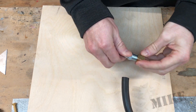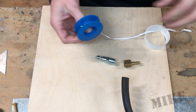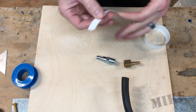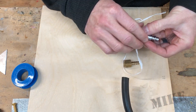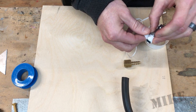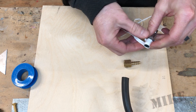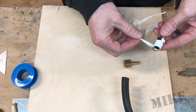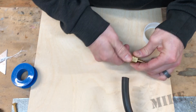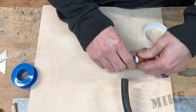So I bought a quarter-inch hose barb. We're going to screw those together. First we're going to use a little Teflon tape — very, very little Teflon tape. Just about three wraps or so is all it'll take. You wrap the tape clockwise always, so that as you screw it together it doesn't want to unwrap your tape. So we'll stick these together here.